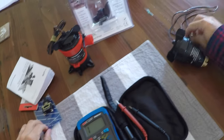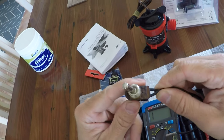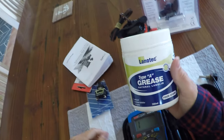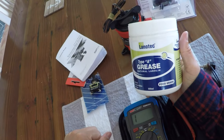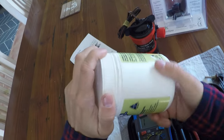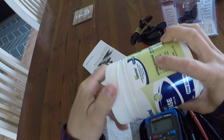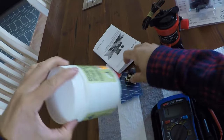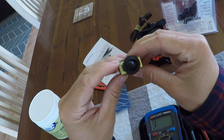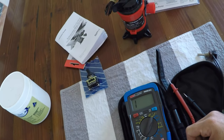Something I also like to do — if you look at this switch, it probably started corroding and rusting inside due to exposure to salt water. So I like to use Type A grease or natural lanolin, which is wool grease derived from sheep's wool. It's natural, sticky, and thick. Before installing it in the boat, I'll smudge it around all the metallic parts to get a bit more life out of these components. I hope that was helpful!